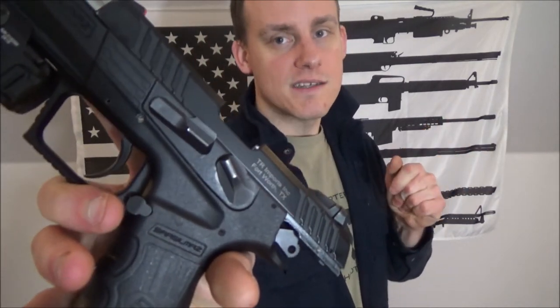The other issue is that a lot of people feel the slide stop is a wear point, and that is true in some cases. I actually did wear out the area on the slide where the slide stop meets the frame, to where the gun didn't even lock back anymore. The slide stop did fine but needed replacement. It depends on the metallurgy and how the pistol is designed. It's called a slide stop because it stops the slide, but it can also release the slide.